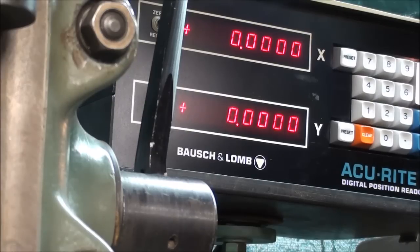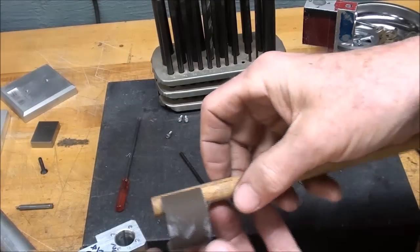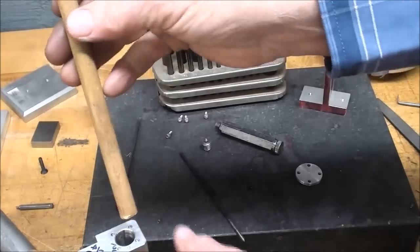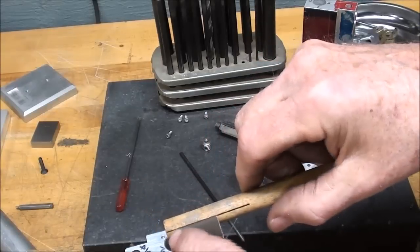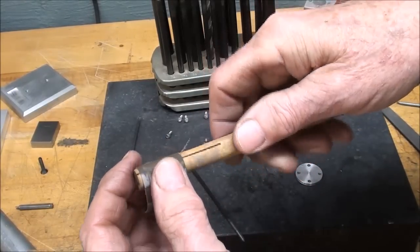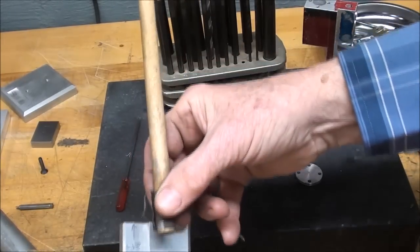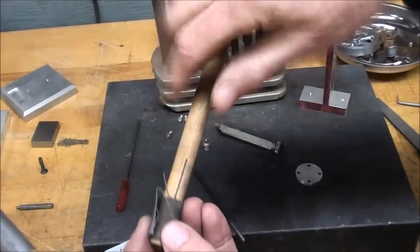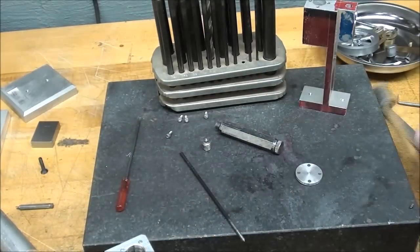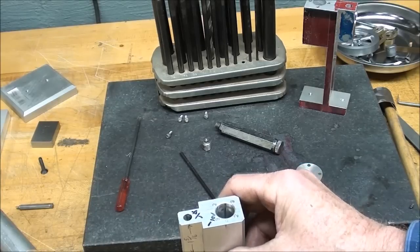You're just going to drill those holes exactly like we did on the body of the steam engine. I also failed to tell you about the poor man's lap — actually it's not a lap but it's an abrasive method. Use a dowel of the approximate size of the hole — a little smaller — bandsaw a slit into it, and wrap some emery cloth of whatever coarseness you want. Put it in the drill press or lathe and run that in there. Make sure you wrap it in the correct direction so it doesn't bind. That method has been around since Columbus.